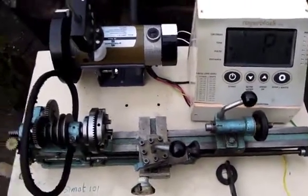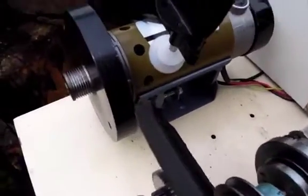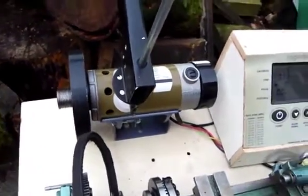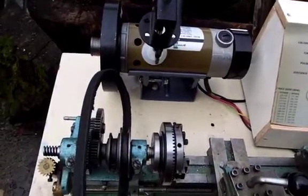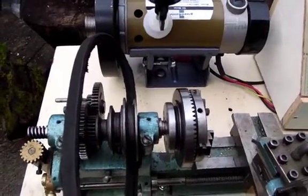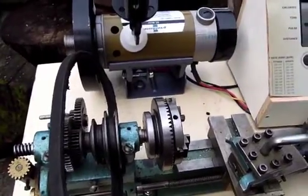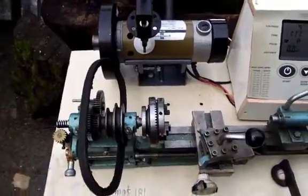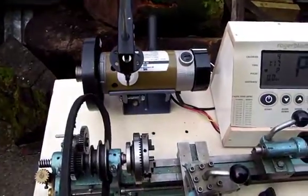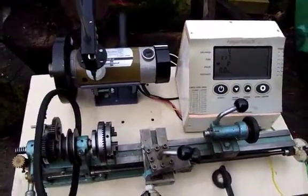I'm going to have to decide how to connect from the flywheel pulley thing on the end of here. This is well and truly screwed tight onto the end of the shaft. The flywheel does add a little bit of inertia to the motor — I'm not sure whether that's a good or bad thing. I'm not sure I need the highest torques. I think the motor's way overpowered for this small lathe, so the fact that I'm running it at a fraction of its true full power shouldn't be a problem. In other words, I don't think I need a countershaft to reduce the speed, because it is a 4,800 rpm motor and we only need a couple of thousand rpm for this thing at most. So there we go — I'm quite pleased with that.